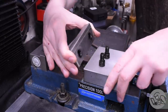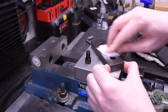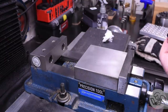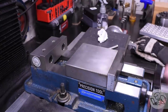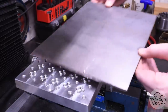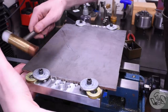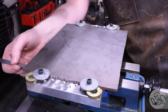I pulled the bolts out of there and they have a really nasty smelling oil on them — I think it's some sort of Chinese factory anti-seize, but I know burnt gear oil when I smell it and that's what that clearly is. My shop smelled like burnt sulfur for two hours after pulling those bolts out. All the precision mating surfaces get a good cleaning, and then I can bolt the jaw back on the far side, which allows you to clamp large flat things in the vice that you might not otherwise be able to. I'm going to be clamping this fixture plate — a 6x12 aluminum fixture plate from Dayton CNC products, hashtag not sponsored but it is a great fixture plate. I'm using some stacks of washers since I don't have quite enough room for strap clamps, and getting it roughly even along the back edge with my scale and a little tappy tap tapping.